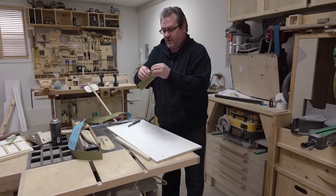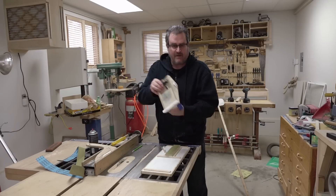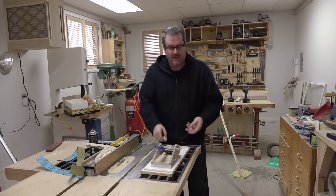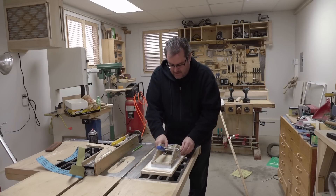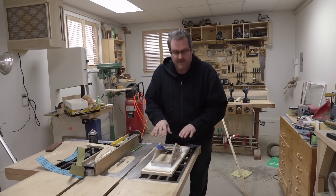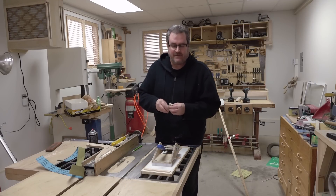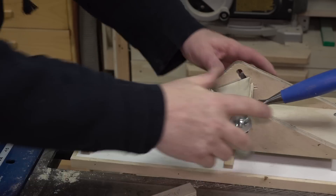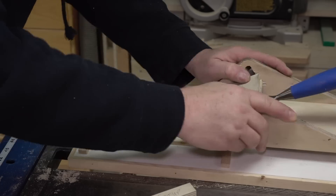Apply some good pressure to make sure it actually sticks well. I've got my jig set up with the three-quarter inch chisel in here ready to go. A comment I got in the video was about the setup blocks — the ones you need to hold the tool holder above the stone at the right spacing. These are just blocks of plywood, just scraps of wood — it wouldn't be a big deal to cut a couple more. I'm using water with a little bit of dishwashing liquid mixed in to spray on the stone.